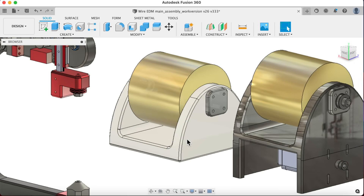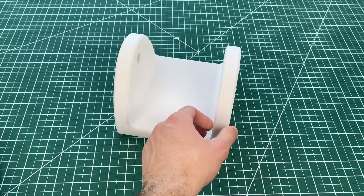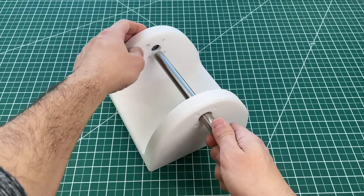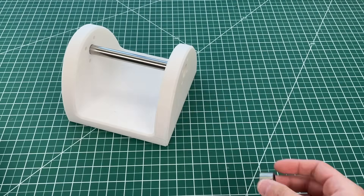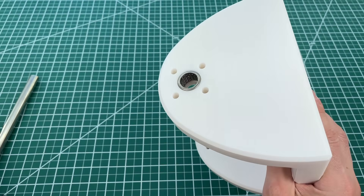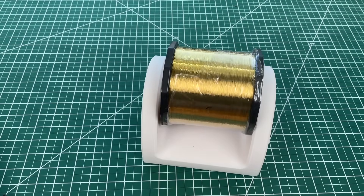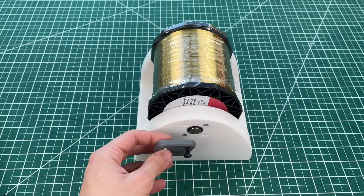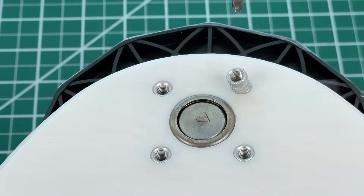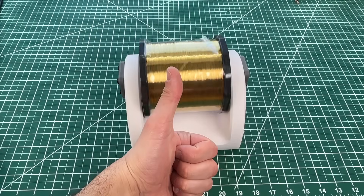One holder is passive and rather simple as it just holds the spool of brass wire, but the other has a motorized system. Let's start with the simple white one first. We printed the files which are available to download on our website. Next we install the rotating shaft for the spool of brass wire — it sits between two roller bearings, one on each side. Installing these is super easy: just place the bearing over the hole and press it in with any clamp; we designed the tolerance to allow for an easy at-home press fit. Note that the shaft can still slide in and out so we need to add caps using the threaded insert trick with the soldering iron. We install our second cap, the shaft is locked in place, and we're ready to move on.